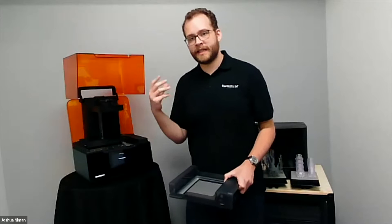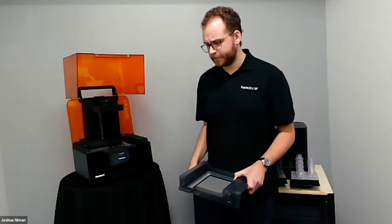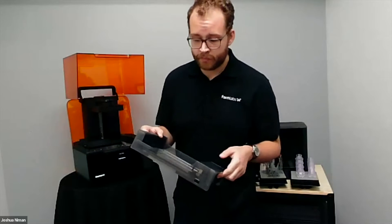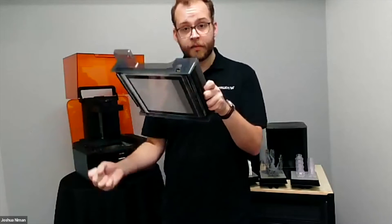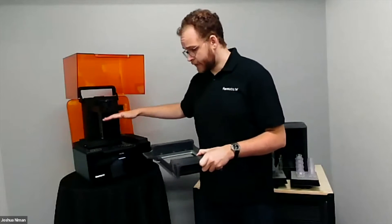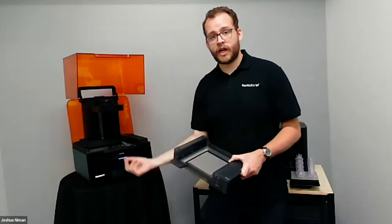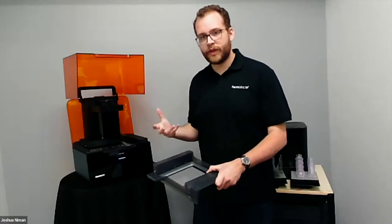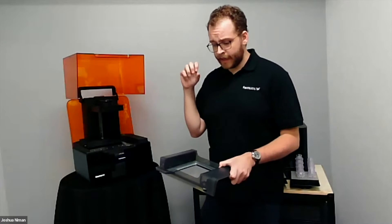Inverting the laser allows you to use only as much resin in the tank as you need to complete a couple of layers — you don't need to fill the entire print volume. That resin goes into the tank, which serves a few roles. It's an optical surface: the film layer on the bottom is what the laser shines through, with resin sitting on top. The platform creates a slight gap between the tensioned film and the platform, the laser cures resin in between, and the platform peels away easily. We can adjust the tensioner motor to slack the film during peeling to avoid stressing your parts.